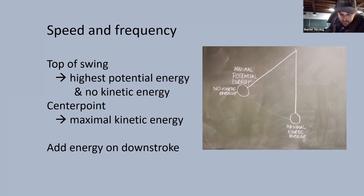That is where the smith comes into play. The smith can add energy by accelerating the hammer on the downstroke. This increases its speed and adds energy to the blow, which gives more rebound for the way up again — in this manner the movement is maintained. As we have seen with the pendulum, the weight and the length influence the frequency. In forging, the weight of the hammer and the combined length of the handle and arm have their own optimal frequency. If you grab the hammer closer to the head, you shorten the total length, making it possible to increase the frequency.